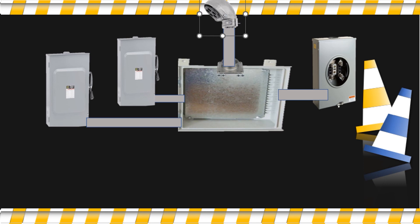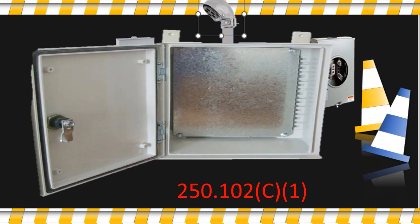Now let's look at the utility's connection. There are a bunch of different ways that this could go down. They could tell you to just do your thing and then leave them alone. They might want you to run wire from the CT cabinet over to the meter. Just work with your local electrical company. But let's imagine that this hot comes down — what they're going to do is slap a CT around that wire somewhere. What they're doing is counting the current that's going out and in. There are a couple different types of CTs that they could use, and they might wire them differently. They slap a CT around each hot and then run it over to their meter. Just depends on where you're at.